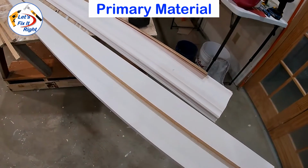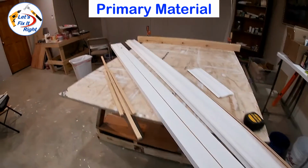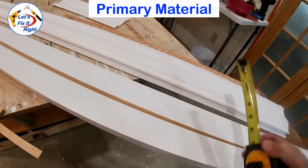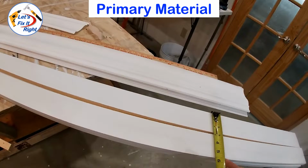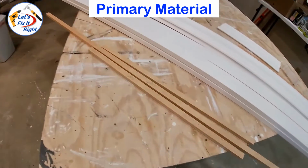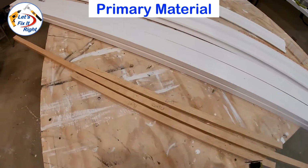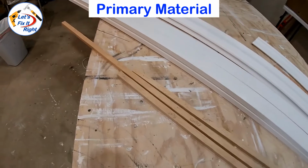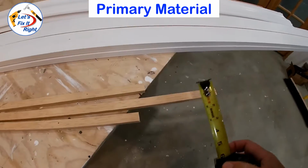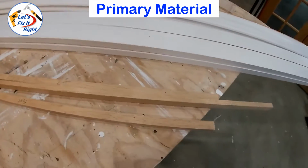And we'll be using this pre-painted pine that I bought from Home Depot, which I ripped in half for the baseline frame. Prior to cutting, these pre-painted pieces were 5 1/2 inches wide. We'll use this stock for crown molding alignment guides to secure the crown molding while we're gluing and nailing the molding in place. And it's 3/4 inch wide and 1/2 inch thick.